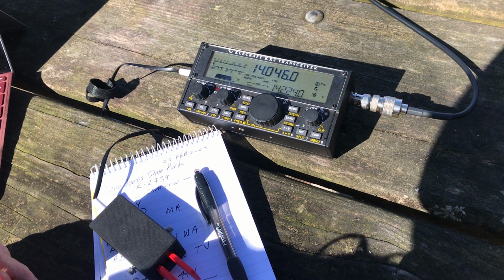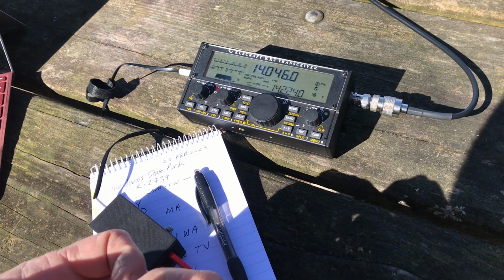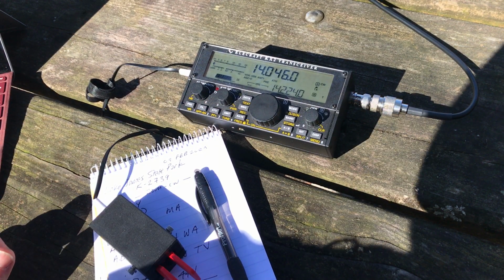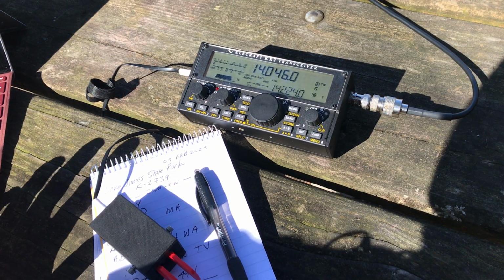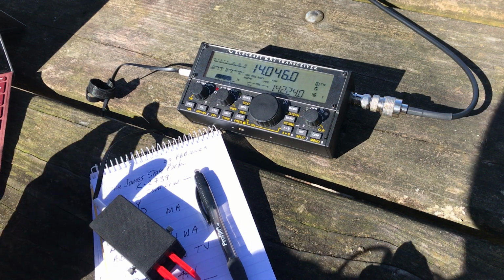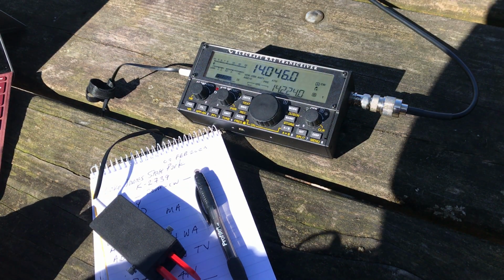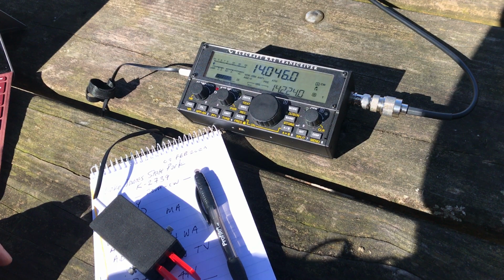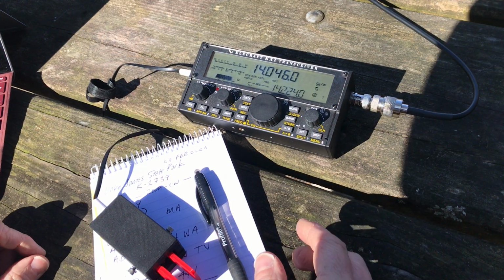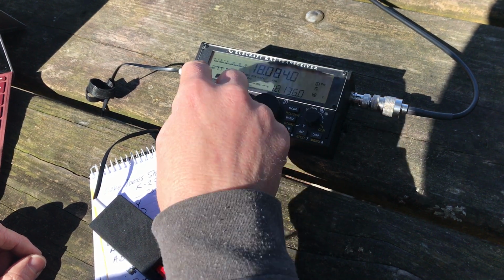But if I want to switch bands or frequencies at all, I usually have to go retune the thing. So I've got to move the little coil tap up and down and find a nice spot. And I try to mark them off, but they rarely are exactly where I thought they were. And so you do have to do that each time. Whereas with this MPAS 2.0 from Chameleon Antennas and other similar vertical antennas, they act like a random wire. You can just load them up wherever you want to go. So I can move up to 17 meters right now.